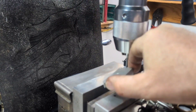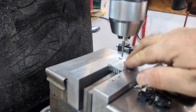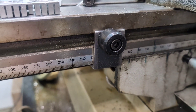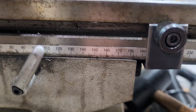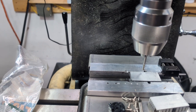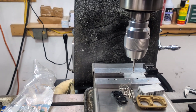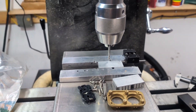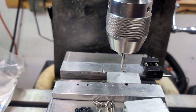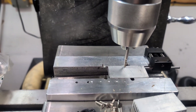Here's how we're going to do this one. I'm going to set the part up in the vise just like this — that goes up against the work stop, and then I've got a stop here and a table stop here and over here. I can move it just a little bit this way and a little bit this way — side to side just a tiny bit — and that's just enough for the slot that I need to drill here.